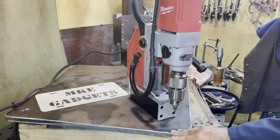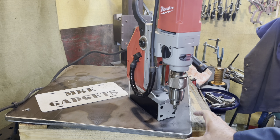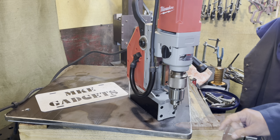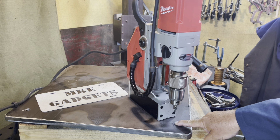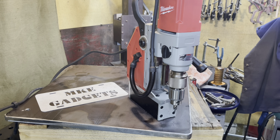So this is our base plate. I took various grinders and abrasives, broke all the edges, rounded the corners off to a one-inch radius. So two inches from each edge, I scribed a line and center punched it. Now I'm going to center drill, drill, chamfer, and tap a half-inch 13 hole on all four corners.